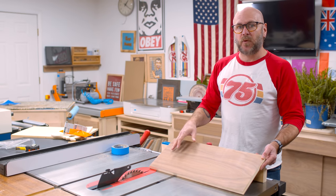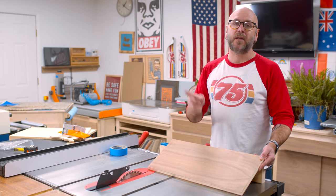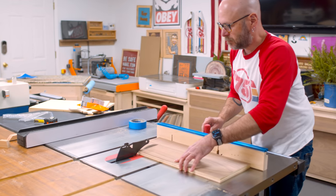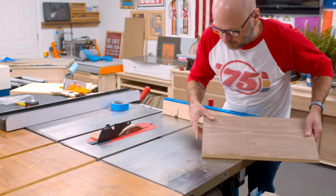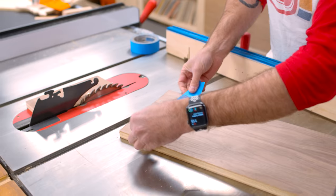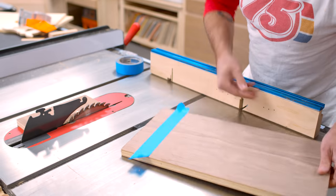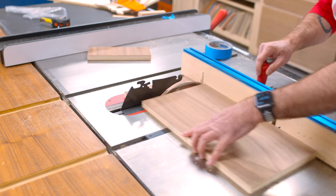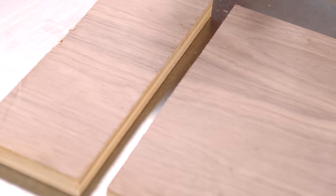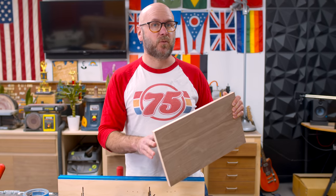The next tip is using tape when cross-cutting the veneer on plywood. If you don't use tape, you're going to get tear-out. I'll do two cuts — one without tape and one with — so you can see the difference. Without tape you get all those little tears and you don't get a nice clean edge. Put the tape on the bottom; the top is nice and clean. It's the way the teeth are oriented on the blade. The painter's tape is just holding those fibers down while the blade goes through. This trick also works with the jigsaw — even more tear-out with a jigsaw if you don't use tape. Table saw: tape goes on the bottom; jigsaw: tape on top.